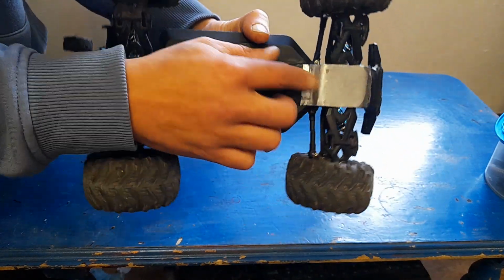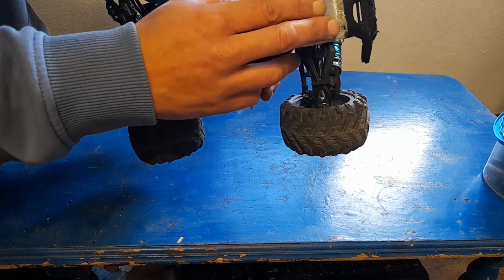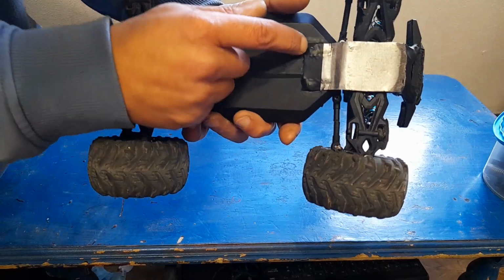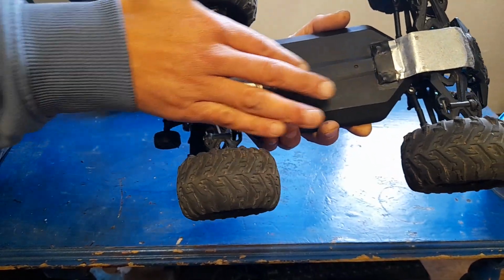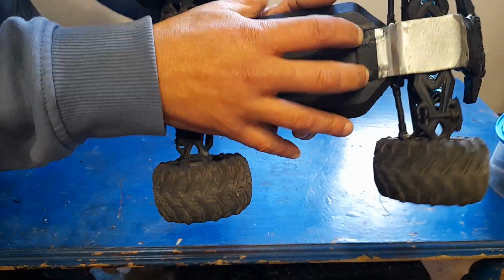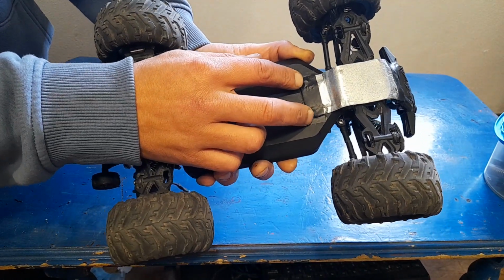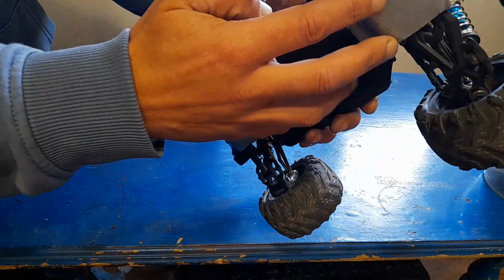1mm thick plate, cut it with snippers, and then I have made 2mm holes with a small drill bit through the plastic, here right beside the central protection of the shaft. You can see it doesn't hurt anything. I used 2.5mm small screws that I bought in a hardware store. It's easy enough to do, as you can see.